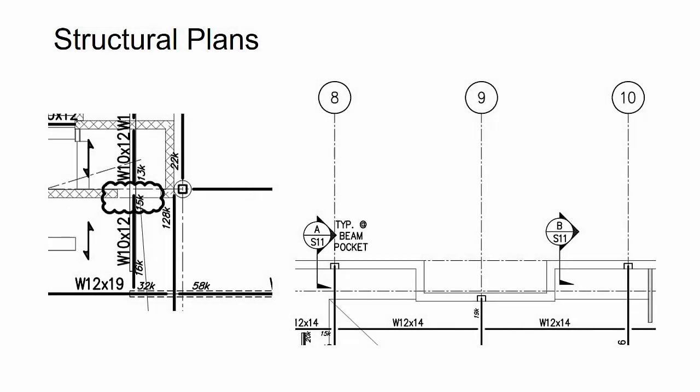All right, so again here, just continuing on structural plans. In the image on the left, this was actually a framing condition scenario that I quickly saw that I was looking for as I was laying out the job in the model. And even before, I was trying to scan to see if I could find all these. Here, there was a very large W30 that was offset away from the grid line because of the framing at the south end of the beam. And it was put right halfway in between this CMU wall and then the column. So there was nothing on the design to figure out how to do that connection, and it's a pretty high end reaction there, so we had to RFI that.